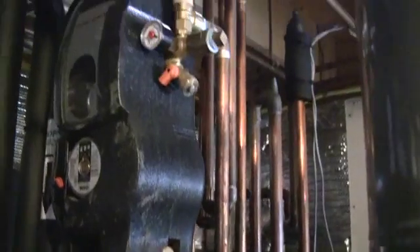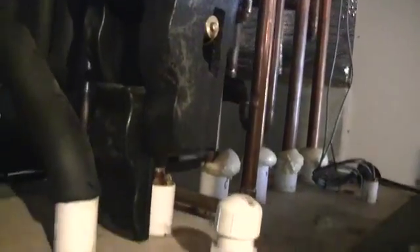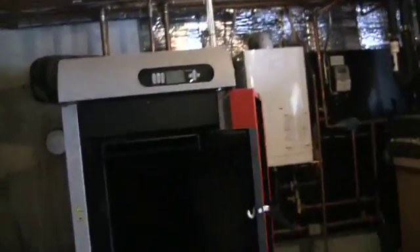You can also see coils for the wood boiler, for it to distribute hot water into the thermal storage tank. I opened the wood boiler and the fan kicked on automatically. You can see below you have the gasification chamber, you have the lighting door, and this is the loading door that's open.